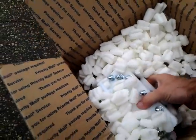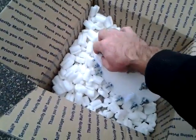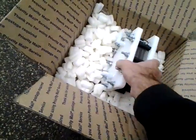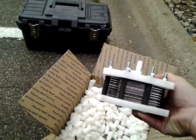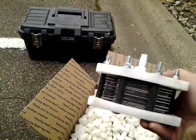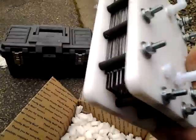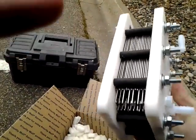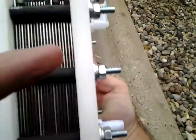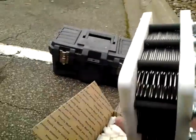Here's the cell itself. You can see the rubber gaskets between the plates. This is a 19-plate cell. Looks like HDPE — high density polyethylene board — the white stuff. And they've got rubber insulators on all the bolts. It's nice.